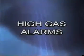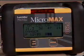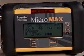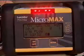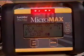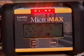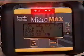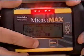High gas alarms indicate a gas concentration above the high gas alarm set point. It is indicated by three beeps, flashing LED, flashing gas range of the in-sensor alarm, and display of the word danger. A low flow alarm is indicated by a continuous audible alarm, flashing LED, and the words low flow are displayed. After 10 seconds in low flow alarm, the display will read pump fail. Then the unit will automatically convert to diffusion mode. The user must acknowledge this condition by pressing the on-off button to clear the low flow alarm.